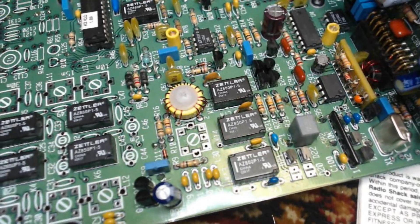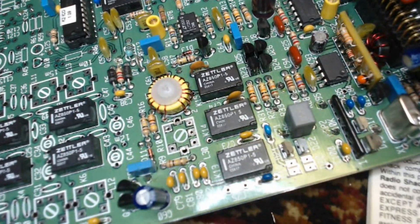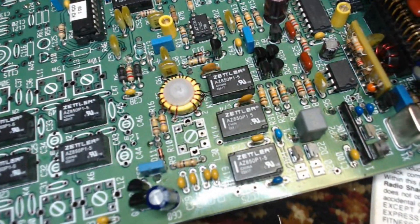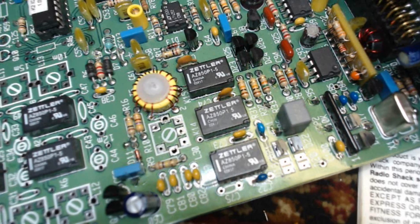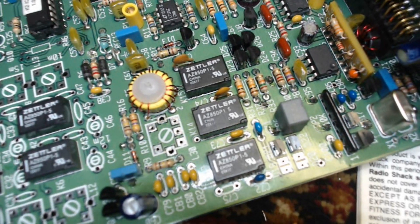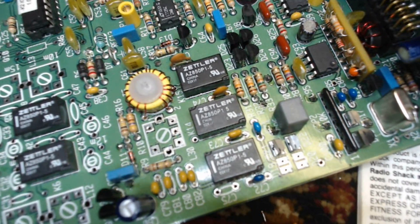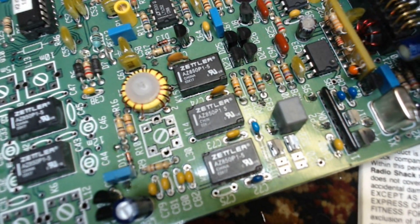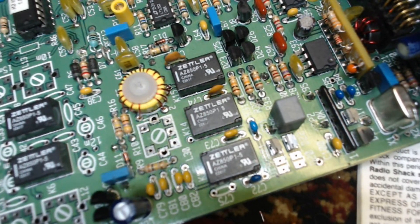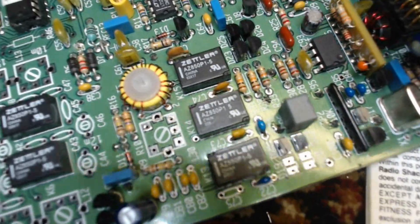Hello again — how's that for a close-up? So you can see there's a spot where the inductor was. I pulled it out. I very carefully pulled out the transformer first, which is the yellow toroid next to it — it's actually a transformer with a green winding and a red winding. I pulled it out and verified with the book that I had it wound correctly.